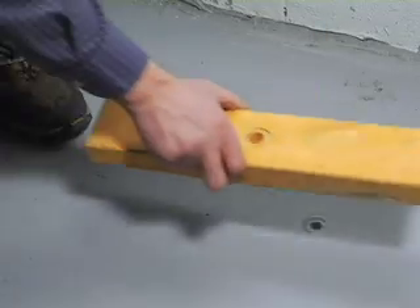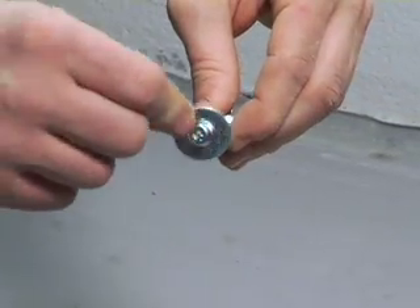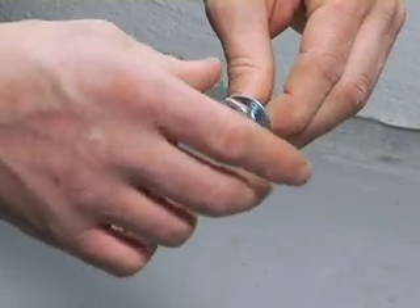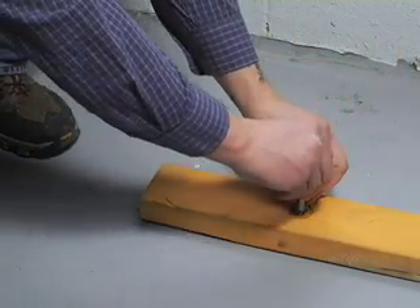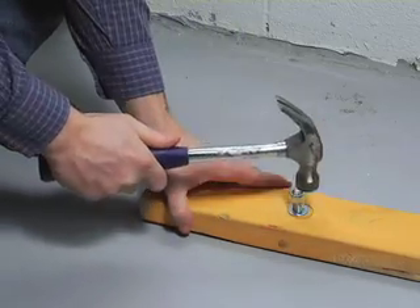Place the fixture over the hole, making sure that the hole in the fixture is large enough to allow the wedge anchor to be inserted through it. Take the wedge anchor and place the nut on the threaded end so as to protect the threads when hammering it into the hole. Next, place the anchor through the fixture and into the hole, tapping as needed to make sure the threads are below the surface of the base material.